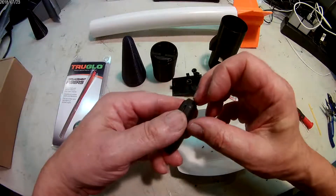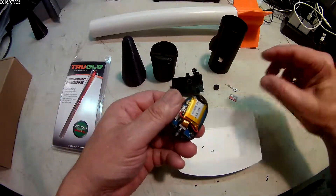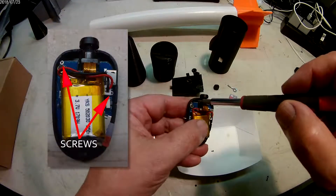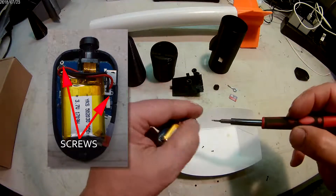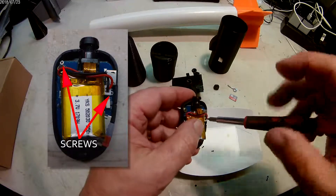The Mate camera will now come apart with just your fingernail — pry it apart and put that piece aside. There are two little Phillips head screws, silver ones, that are on the inside. Undo those and set them aside; you will be reusing those later.